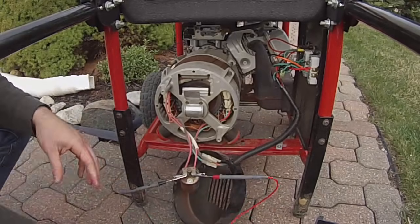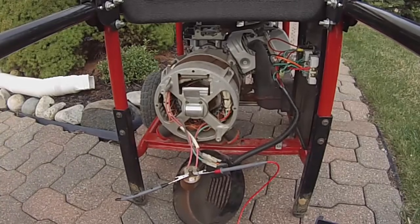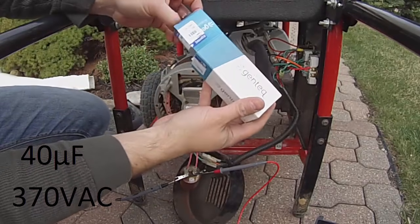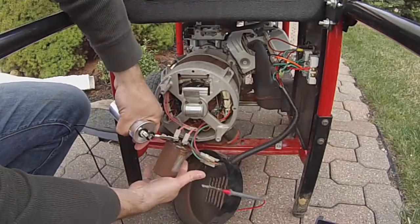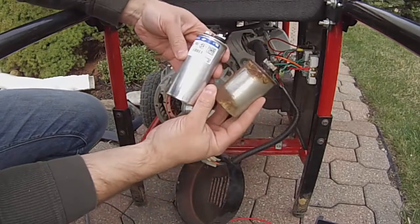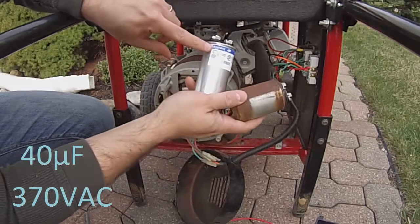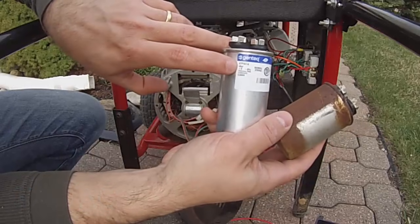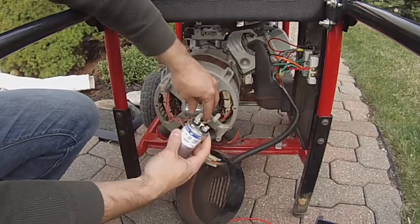This capacitor is covered in a layer of rust, so I can't even read anything on it. I ended up checking online to find the right one for my generator: a 40 microfarad, 370 VAC generator capacitor. The genuine Porter Cable part costs $60. However, this GenTech knockoff only costs $16 with delivery. Its physical dimensions are a little different — it's a bit longer — but it has the same properties: 40 microfarads and 370 VAC. It also claims a 60,000 hour life, and like the more expensive OEM product, it's self-extinguishing, so I won't die in a terrifying fireball if it ever fails.